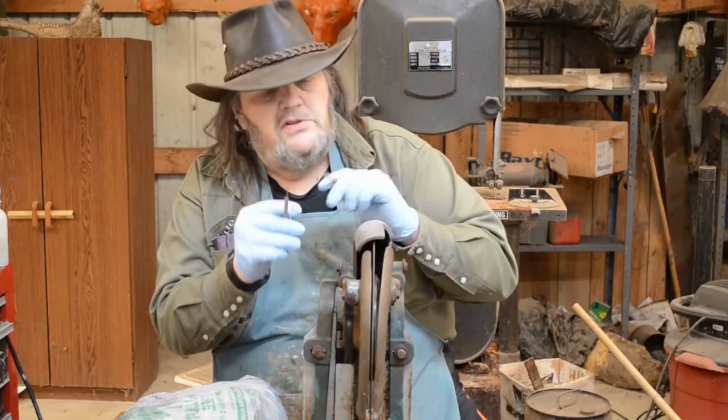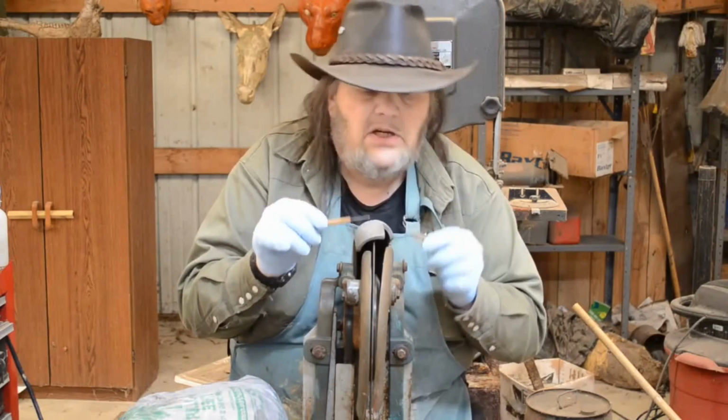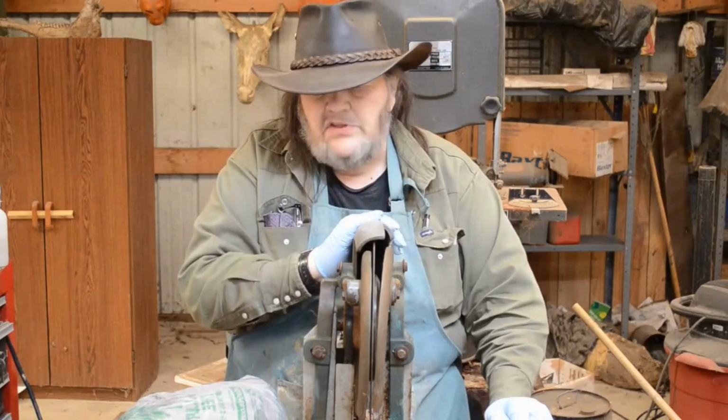And the way you use them is, as the blade is turning, you go under the lip, like so, and then over the top, starting level, and then lightly, you're not pressing into this. Again, you have to have a light touch. You lightly angle the top sharpening steel slightly downward, so you're getting just ever so slightly a biting edge on this thing.